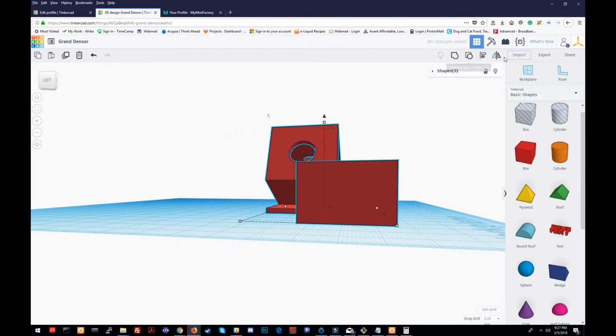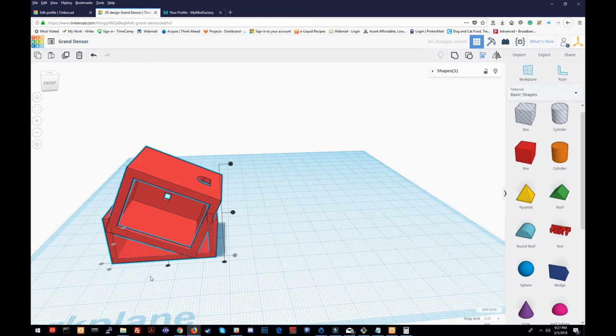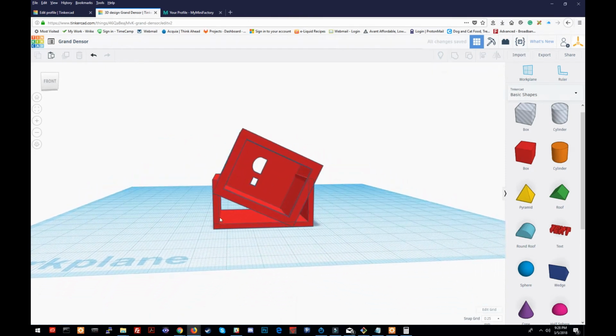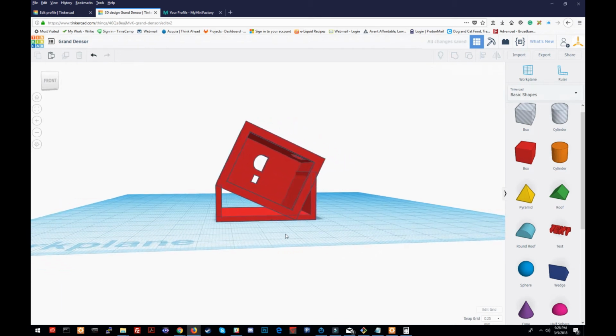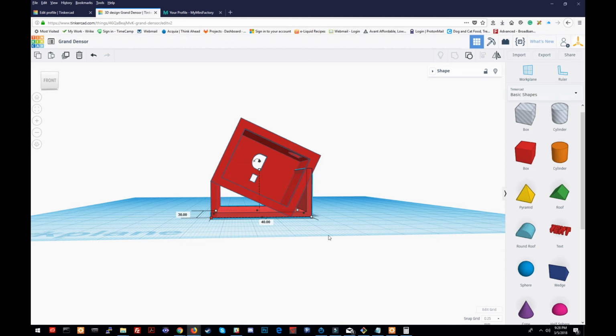So what we're going to do is use our same aligning tools with this part. We're going to get that center aligned to it, and then we'll hit the edge and it'll drag everything over. And once again, you can see with this, my base table is long, but I knew that going into it. So I'm going to drag this in to get a feel for how far I'm going, and then we'll change our base plate size. So I already know I'm going to come in a couple, 3, 4 millimeters, so I can go ahead and lower that part. So change this.